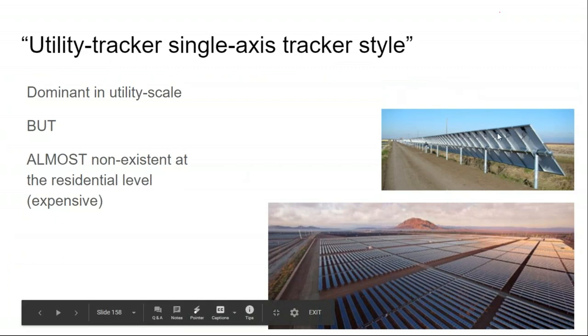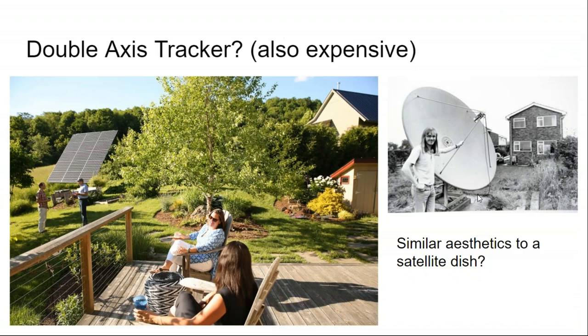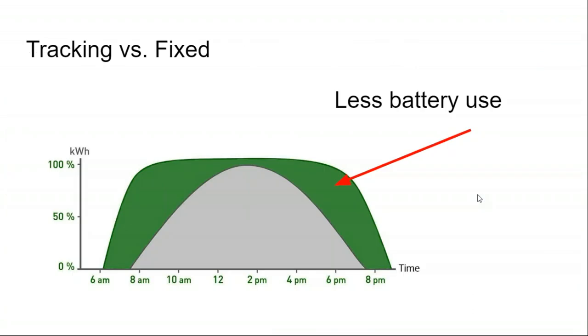Whereas the single axis trackers, they're not trying to lift nine panels on one post. In fact, they're really only trying to lift one panel on one post. And so you still get into kind of shallow foundation depths. I think there's a lot of good value optimization in these utility scale trackers. And so why not, if you're building a ground mount at the residential level, add the additional parts and pieces you need to make it a tracking array?